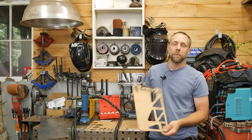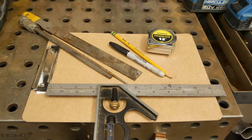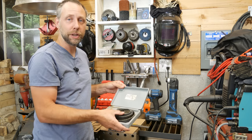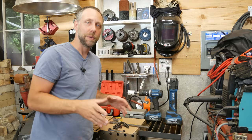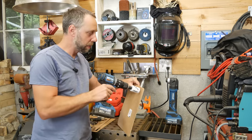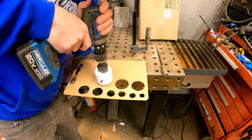The beauty of these is you can make them, cut your jigs, make custom stuff, whatever you want, hang them on the wall, and grab them for a quick application anytime. To make these, it's very simple — you need some clipboards, something like a Sharpie or pencil, an adjustable T-square, and a tape measure. I ended up using my hole saw kit. You can get really large hole saw kits that are el cheapo from Harbor Freight for about 10 bucks — you're just going through masonite basically, so it should be just fine. One tip: when you go to drill, don't drill all the way through. Drill halfway through the clipboard, flip it over, use the pilot hole, and come through the other side — it just makes a cleaner edge.